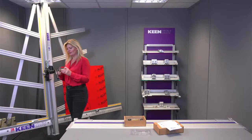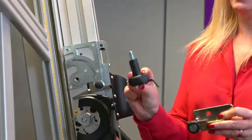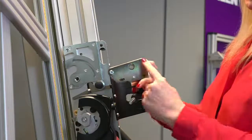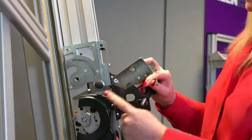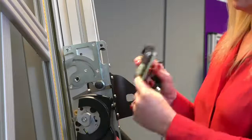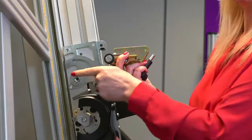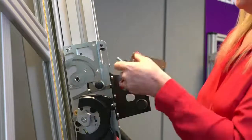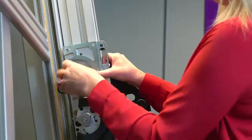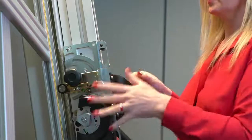I now have my V-Grooving tool, my installation knob, and my Allen key. At the back of the V-Groover, on the back plate, there is a polarising key that will install and go here. The blade itself has a number 3 on it — all of them have their number. The blade of the V-Groover has to go in the direction of the spine, and once it's facing towards the spine, you can house it with the knob, screwing it firmly in place. Once in place, it's quite secure and not going to be moving.